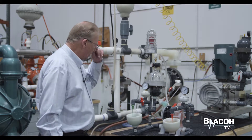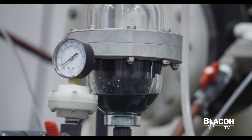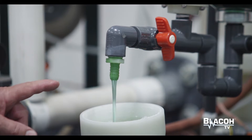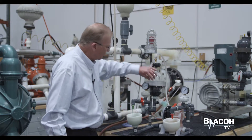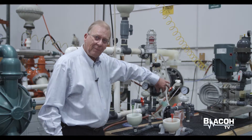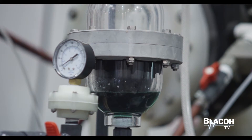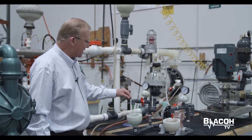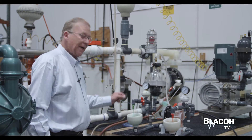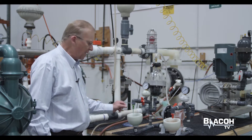On this side of the pump, we are using a pulsation dampener. You'll notice that every time the pump strokes, the flow stays in motion in a continuous amount, because we have accumulated a small amount of the liquid in the dampener, and as the pump shifts, the dampener pushes some of that accumulated liquid back into the system, keeping the product in constant flow. Also, no pressure variation will be observed as the flow is steady and constant.